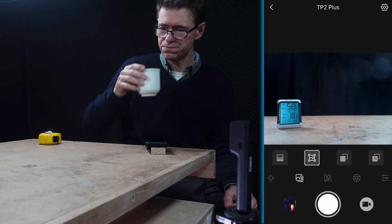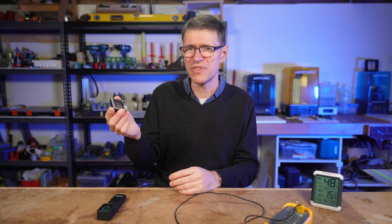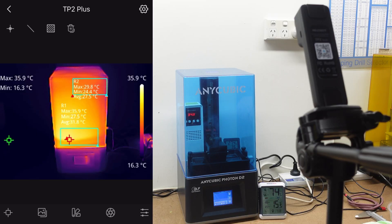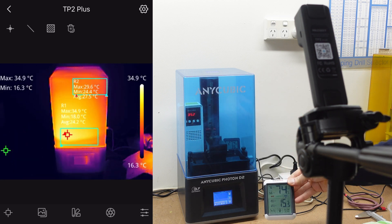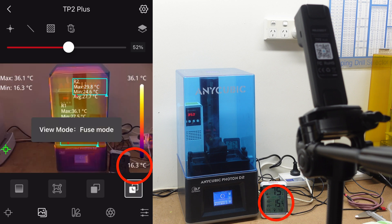So what does all that look like in a real-world test? Right now it's cold here in Australia — only 15 degrees in the workshop — and 3D resin printing in cold conditions causes all kinds of problems. I've always wanted to know how effectively I've been heating my resin. I've been using small thermometers, which kind of works, but using a probe isn't practical because I don't want to stick that into a vat full of resin. This is my Anycubic D2 DLP printer running a print. The recommended temperature for resin printing is usually above 20 degrees — anything colder and you get adhesion and layer separation issues. The chamber heater is set to 35 degrees to allow for the cooling effect of ambient temperature.